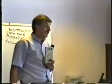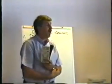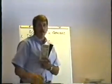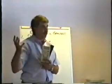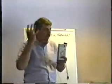Capacitors are funny like that. Sometimes when they're cold they won't work, but as they warm up the problems go away. You see this on monitors a lot. When you first plug it in it looks like crap, and then after it heats up, the sides straighten out, it gets bright, and it looks okay. Those are typical capacitor failures.